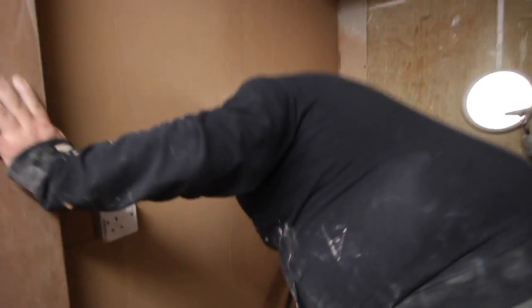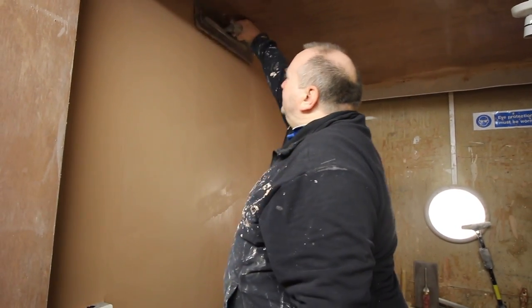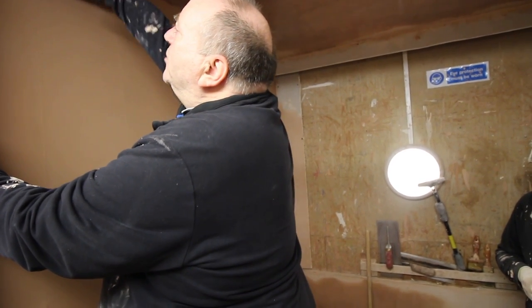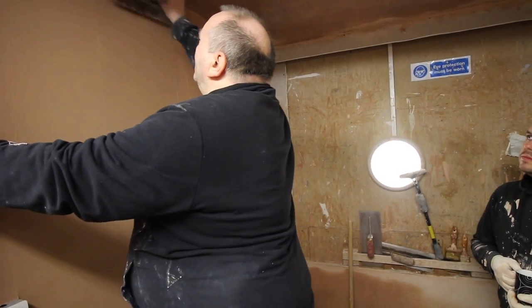So basically what I'm going to do now is bring that trowel up first, lift it off, leave a wee hollow there, pop some stuff in it, nice and flat for the top. Then rounding off, back up on that line, take it off, tighten at the top. You're just making sure that round's filled up. See there's wee holes up the top corner there? You just got to make sure you're filling the wee bits in as you're going, so there are no holes left.